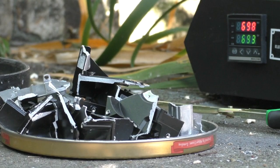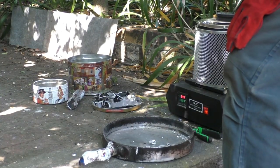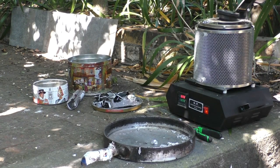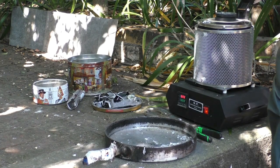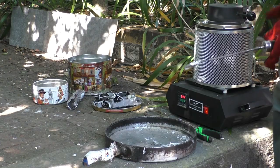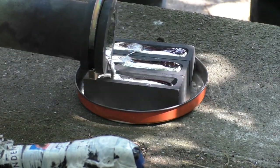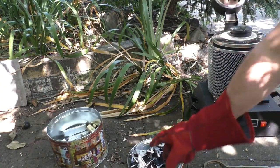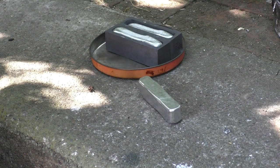I skimmed off some dross, because the hard drives have powder-coated paint on them — there was a fair bit of dross from that and from warranty stickers that burned off. I cleared the dross off before pouring the ingots using a tool I made up. They poured pretty well. I've got three little graphite ingot molds, and I just do three at a time. While they were cooling I'd load up the crucible again with the next batch of hard drive scrap. The ingots would pretty much just drop out of the graphite molds.